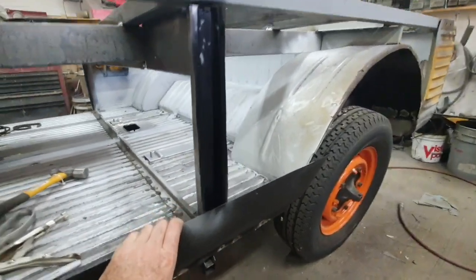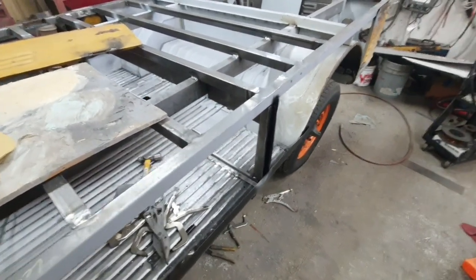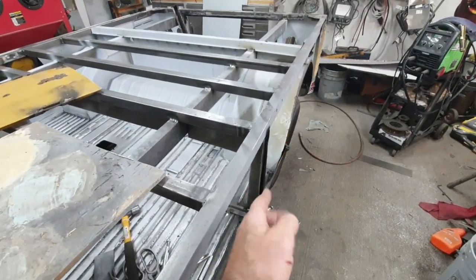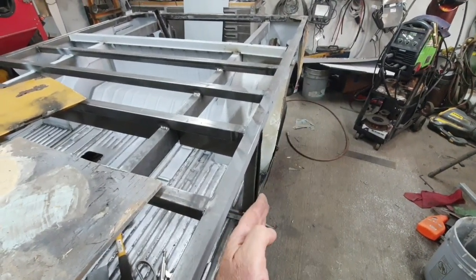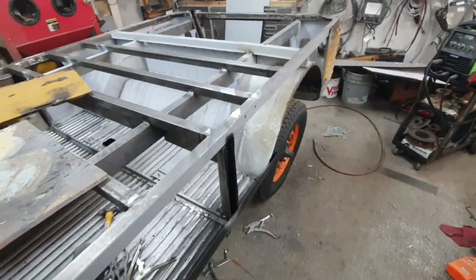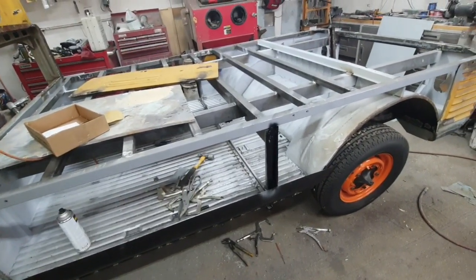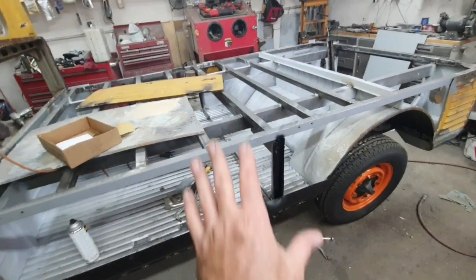And it also is paintable urethane caulk, so it works pretty good. So I'm going to probably just put that on, and then it's flexible. If I weld it, it'll have little spot welds to fill. It'll probably warp a little bit, so I was just thinking about that. I might just do it that way. I'll get the panel on and then check it. I don't know for sure how I'm going to do it, but anyway, just thought I'd tell you about that real quick. So that's on. All this stuff is ready.